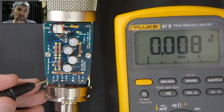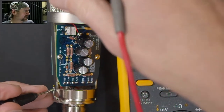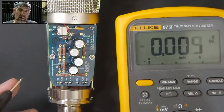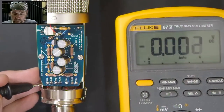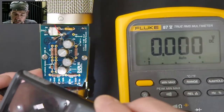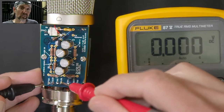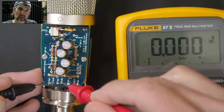One of the first things to check: the black probe can be any part of the mic chassis anywhere that the probe will stick. What I like to use — if you can get test leads for your multimeter that have an alligator clip on the end — that's really helpful because you can clip it onto the mic chassis and don't have to worry about holding two things at the same time. First thing to check is XLR pin one, which is ground and should be zero. And there it is — zero volts. That's exactly what you want to see.